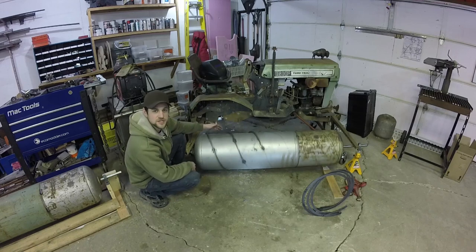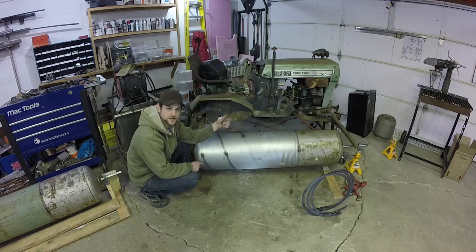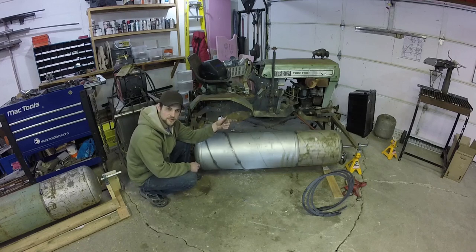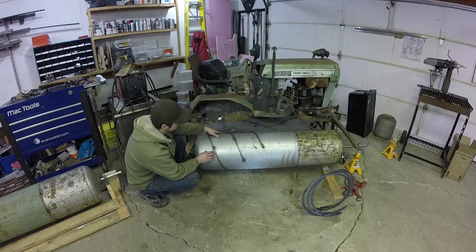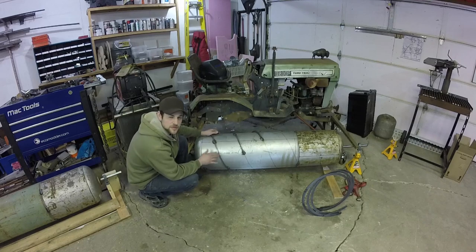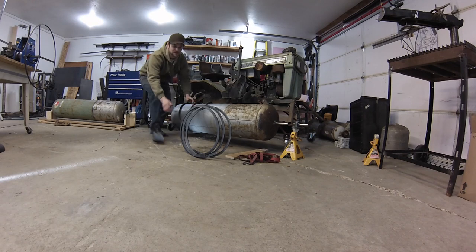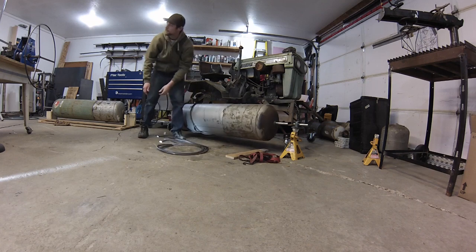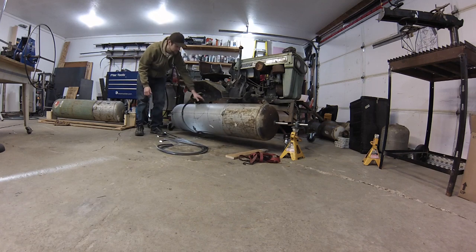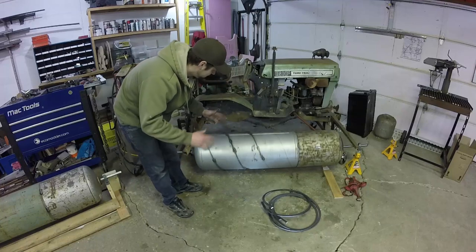But you can see the shape that's taking place here. It's looking pretty good. The formula that I'd used and the farmer told me of, dividing by 1.13, actually did work, believe it or not. So approximately 15.1 inch circles is working out on this tube. So I've bent up some more and I just gotta cut them and keep going. But it's gonna take time, it's gonna take longer than I thought, but I think it's gonna work.